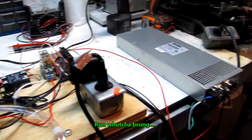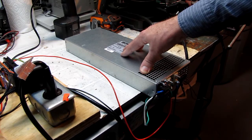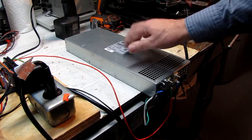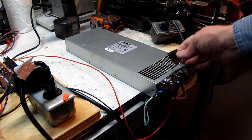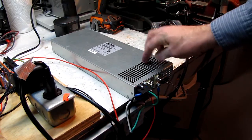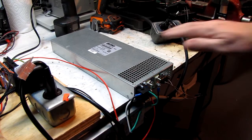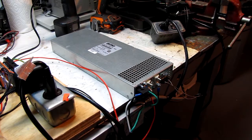Last time you saw this I had a great big analog power supply. These are 48-volt nominal — you can tweak them up to 50 volts at 25 amps. I've got two of these, and they're designed to run up to three in parallel with jumpers between units to equalize the current. I tried for two seasons to sell these at the ham flea market — spring and fall, four times total — at $30 each or $50 for the pair. Nobody would buy them. You'd get appliance operators asking if it'd work with their XYZ transceiver, and when they said it was made in Japan I'd say 'oh, this uses Canadian electrons — you'll blow something up' and they'd wander away.